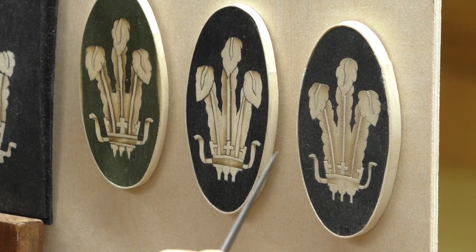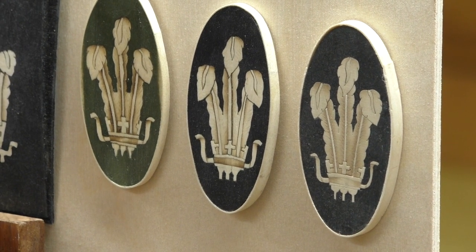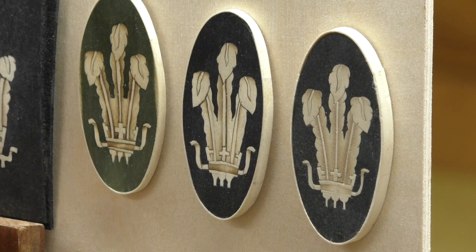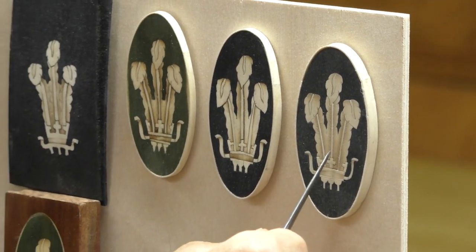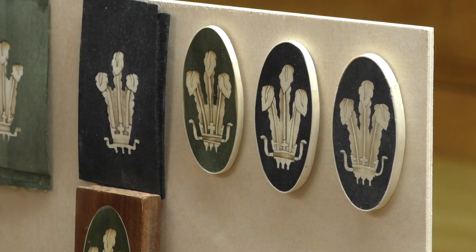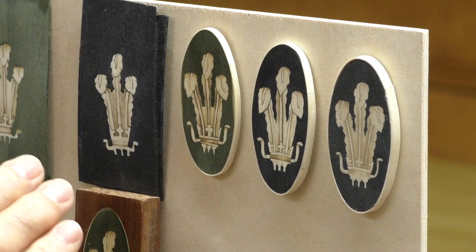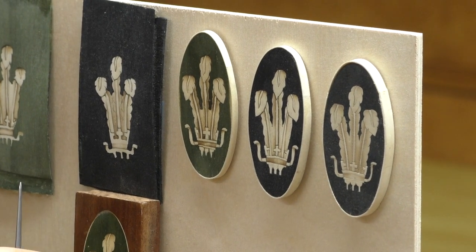And the last thing I learned was the feather lines. I originally planned to cut the feather lines with my handsaw, but you couldn't make very many without destroying the piece. So I ended up taking an X-Acto blade to scratch in feather lines, smeared the whole surface with hide glue, which darkened the lines themselves, and then scraped it off and finished it, and it gave me a darker tone in the lines to indicate the feathers.